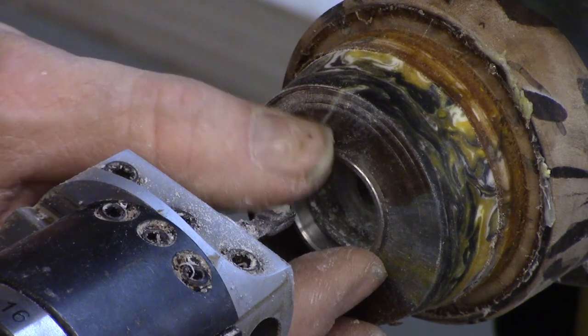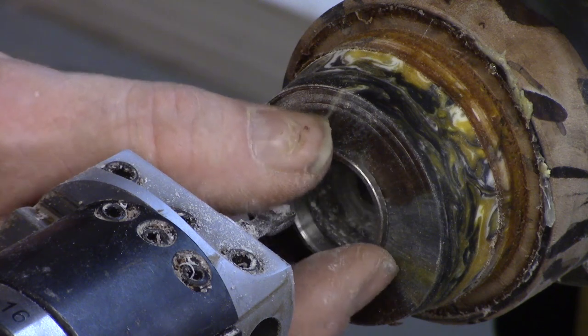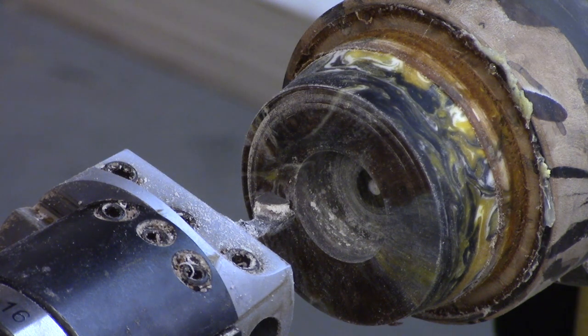Could you use a urethane, like a Gorilla Glue? It would expand and work there, yeah. But then you have to clean out the inside of the core. But for a CA finish, which we're going to do today, it may wind up with some gaps in there. And if we wind up with gaps, then that's going to be a bad spot that it wants to break at.